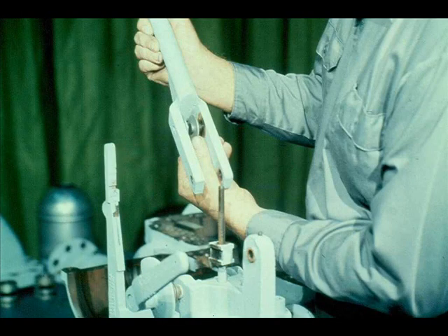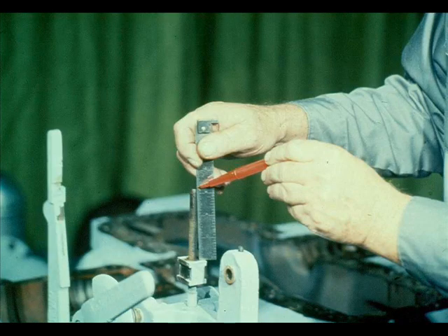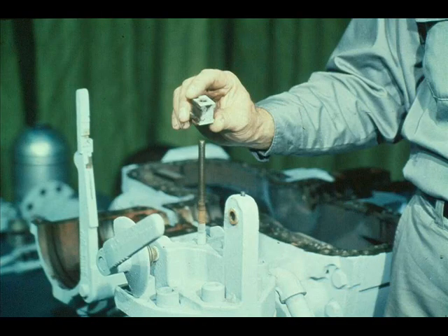After your measurement is completed, remove the valve stem connection block from the valve stem. Our next step is to remove the auxiliary resetting lever. However, before you can do this, you must remove the locking devices which hold the lever to its bracket. Now you can slide the lever out of its bracket. As you can see, it also includes the return spring.